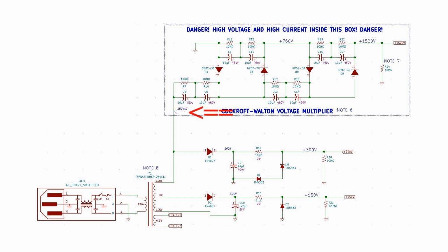You can see that the power transformer is labeled as providing a 250 volt AC output to our multiplier circuit. But Labguy, 4 times 250 volts is not 1520 volts as indicated on this drawing. Au contraire. First, understand that our transformer, though labeled 250 volts center tapped, is not necessarily so. Plus physics and math. Oh dear. It's not so bad. Watch.